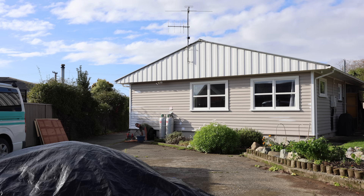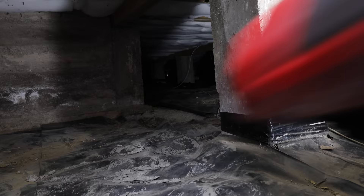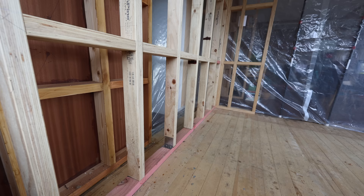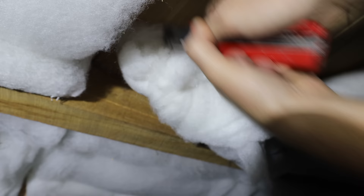So basically, that just means someone has to go under the house. The reason why I'm under here is that we need to put bolts in that new wall. If Scott drills from the top, then we know where the bolts go underneath. We need to knock out between the floor joists. But if he drills now, his spade bit's going to get stuck in the underfloor insulation, so I need to pull that out first.